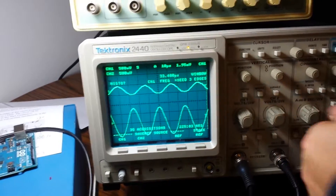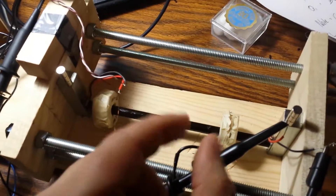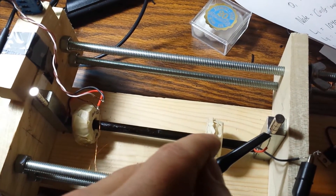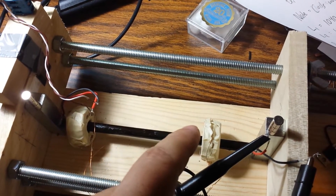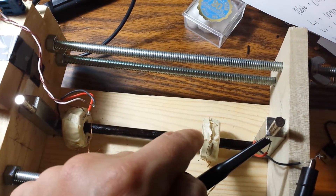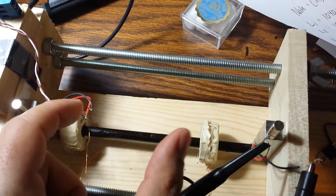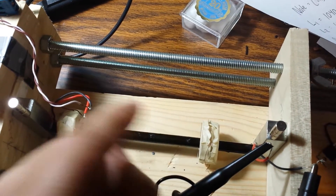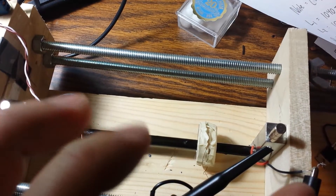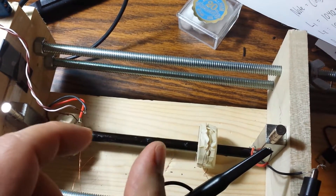It's more of a solenoid action than magnetostriction. If this was magnetostriction — which it's not — having a magnetic field here would either oppose or align with both sides. Say this is south and this is north, and this alternates between being north and south or south and north. If this is south, these fields oppose and you have disorientation here. This is north, and this disorientation results in total overall constriction.